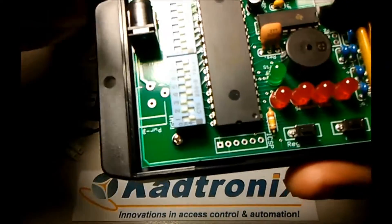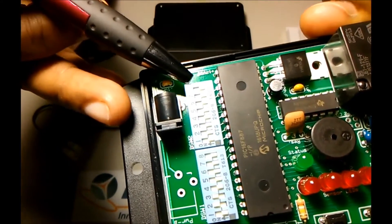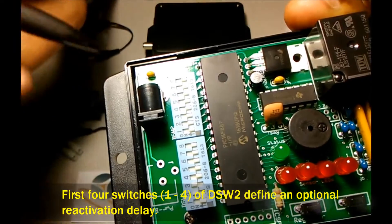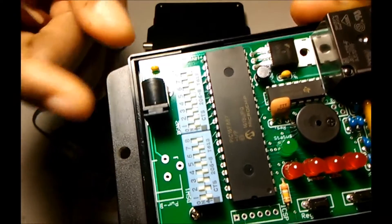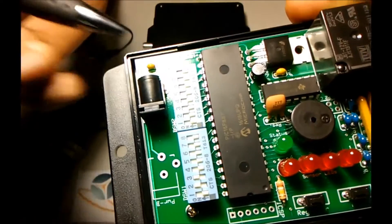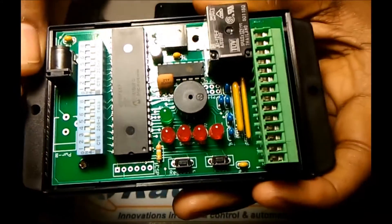So that means the door or window has to be open for two minutes before the system shuts off. The second bank of switches, DSW2, allows you to configure an optional delay for restoring operation. For example, if your door was open and the system shuts off, when the person closes the door, this set of switches would allow an additional delay before the system restores normal operation. That is optional.